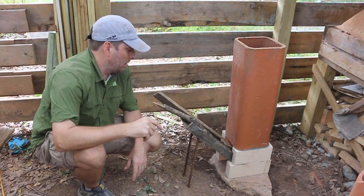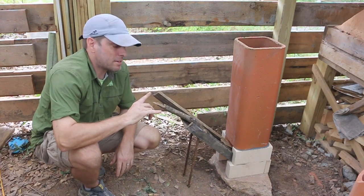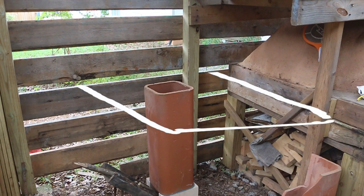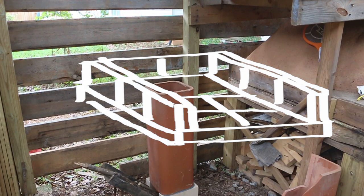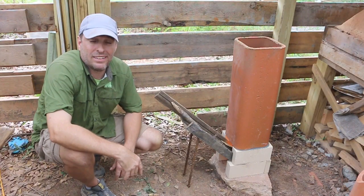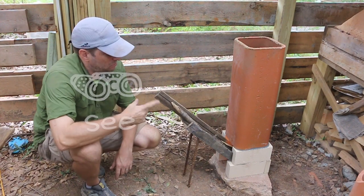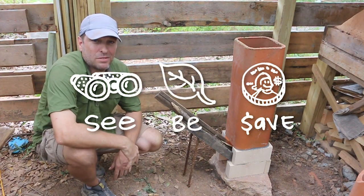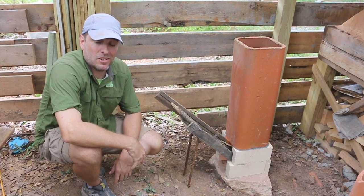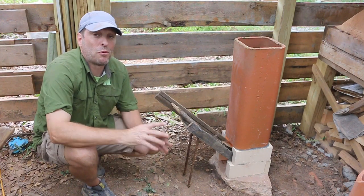So this brings us to the end of part one — the terracotta flue liner and firebrick rocket stove, the burner that's going to fire a pizza oven. For reference, the pizza oven is going to sit on the top of this — the floor and walls will be built with firebrick, and then there'll be a concrete and perlite arch to form the top. My plan is to build the oven over the next couple of weeks. As always, our mission here at Green Shorts is to help you see green so you can be green — and save a little green by doing it yourself. Thanks so much for watching. Please like, share, and subscribe for a new Green Shorts DIY video almost every Friday. If you get a chance to check out my Kickstarter page for the Rocket King rocket stove made out of stainless, I would really appreciate your support.